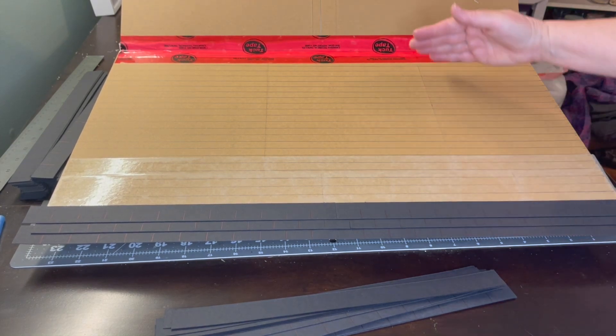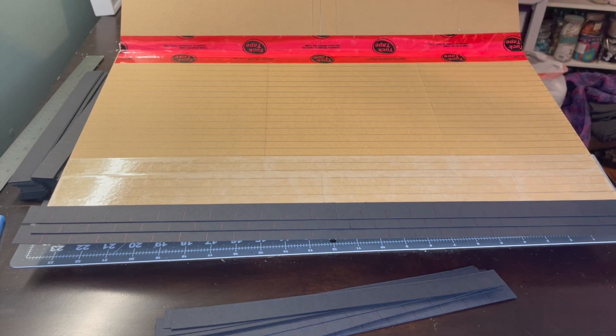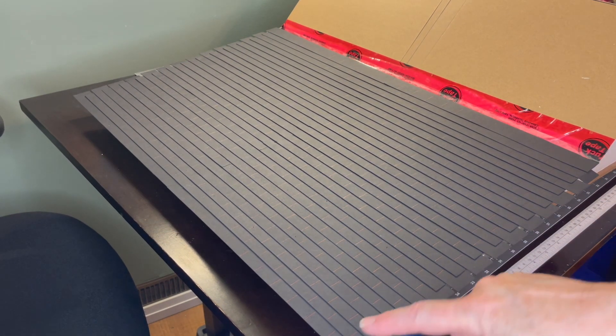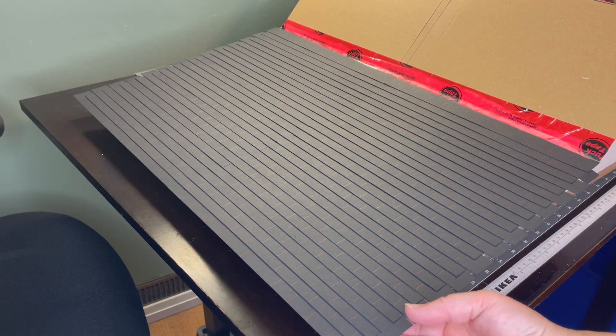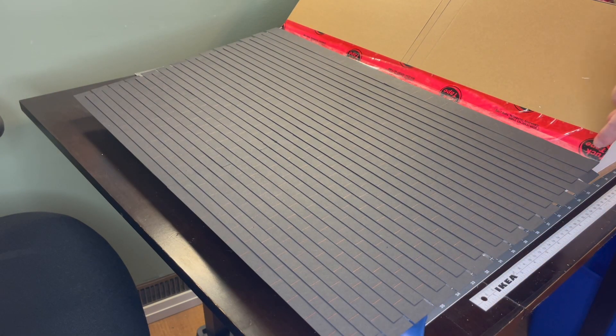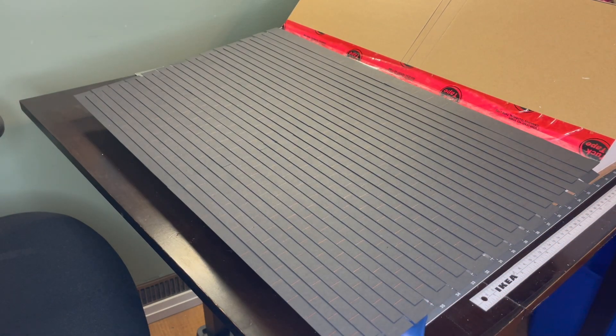We're just going to carry on all the way up to the crease where the door opens, then go up to the top. Here we have the first and largest section completed — I still need to trim the edges, but it does still open. I brought the top row exactly to the crease so the roof opens without restriction. You don't need to go right to the very top because a ridge piece will finish that off.